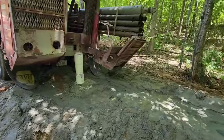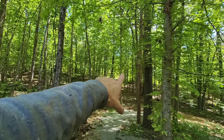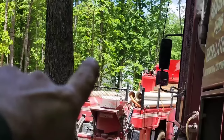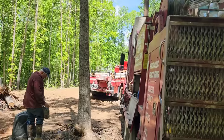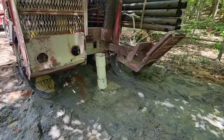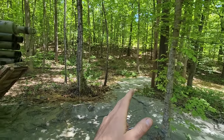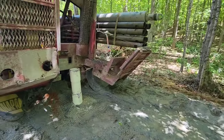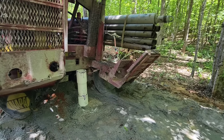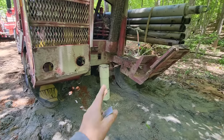There were a couple of reasons why I wanted to record this well in this neighborhood. I've got a well right over there that's 225 feet and makes 30 gallons a minute. I've got a well right up at the top there that's 165 feet deep and makes about 50 gallons a minute. And here we are in between both of them — at 400 feet making only a gallon a minute. That's just a little bit of understanding that just because your neighbor makes a lot of water doesn't mean you will. That's why it's so hard for us to quote jobs when customers want to know how deep it'll be.